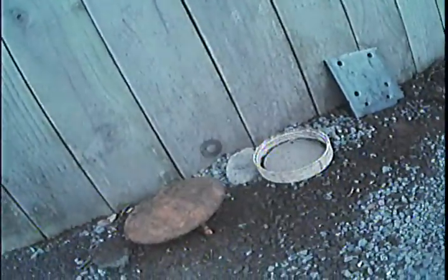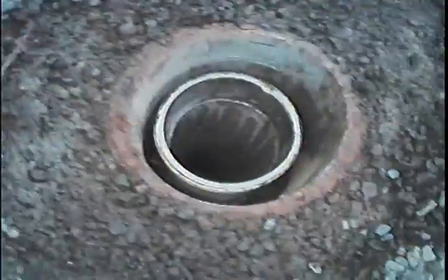So there is our access point, driveway, fence. There's a little marker you can see there, a little washer, directly out from that washer. Go through here and check its applicability. And we changed to earthenware just then from the PVC, obviously only enough PVC for the junction. We're down 10 feet from the reel right now.